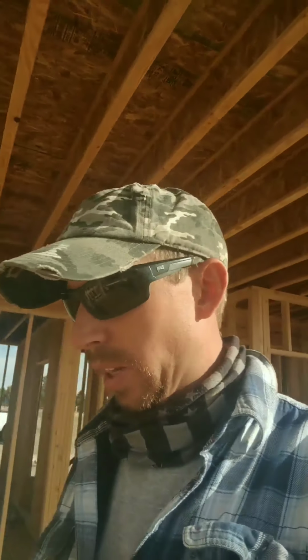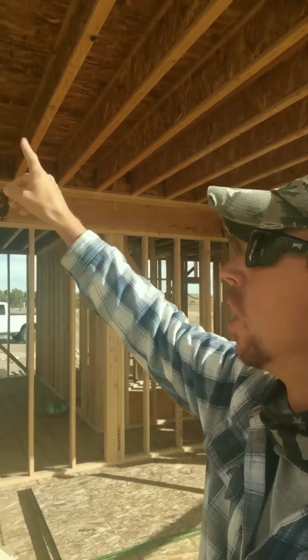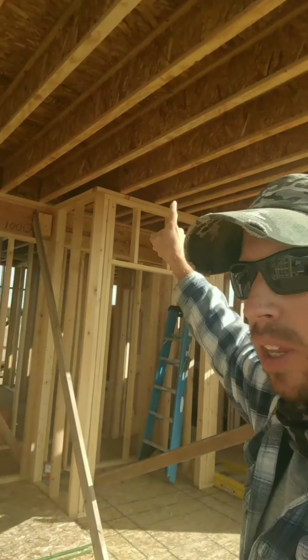Let's just say that. And then all these I-joists, we use these BCIs, as they're called. Got a 16-inch on center pattern, which mainly means if you measure side to side or center to center, they're 16 inches on center, and that works out for your sheeting and strength. So pull the pattern on this beam, pull the pattern on the back wall, and then the lumber company cuts these joists to the foot, or sometimes they give you extra depending on what they have, and then you cut down to the inch. So I figured out what each one of these were and made them all the same,